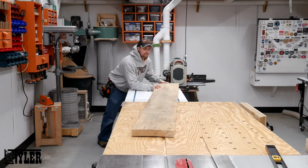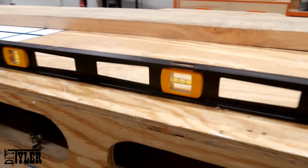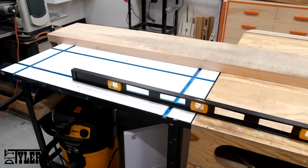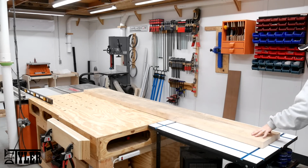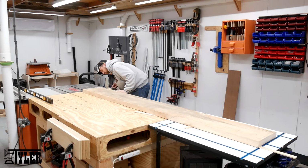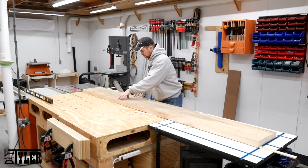Now you guys probably know that a planer only works if you have a square side to begin with, so I used my assembly table, which is nice and flat, extended it with my Rockler T-track table, made sure everything was plumb to one another, and then laid down my slabs, used some shims to make sure they didn't rock at all, and then grabbed that 2x2 square tubing and laid it on either side to give me a nice flat reference surface for a router sled.